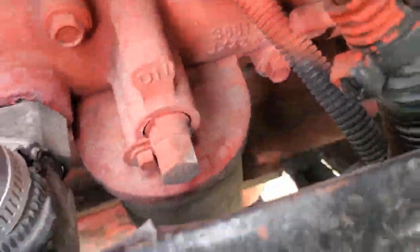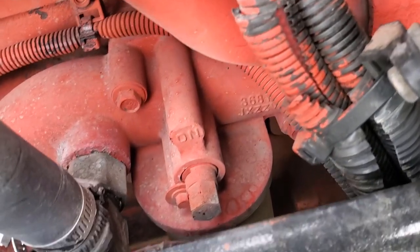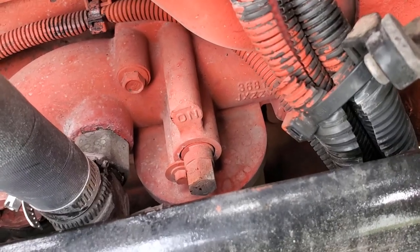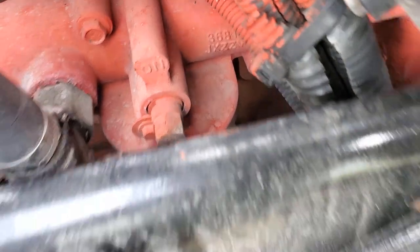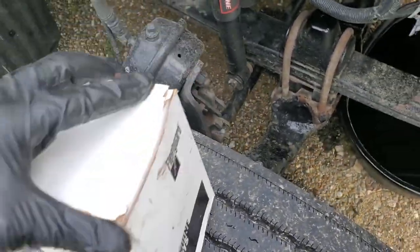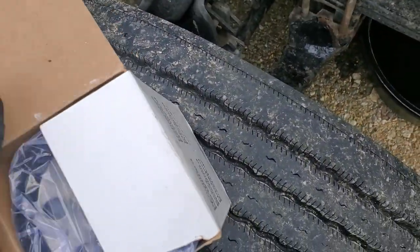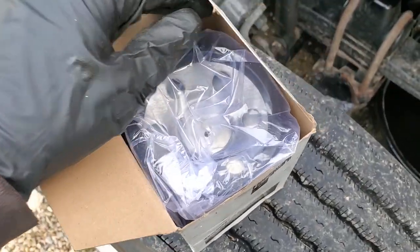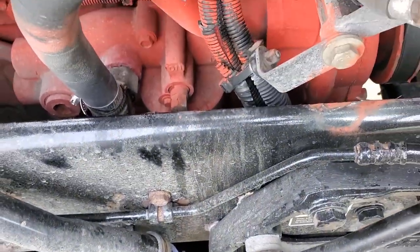The coolant filter is right here. There's a valve — you turn it counterclockwise and that'll shut it off so water isn't draining out. Then just spin the filter off with a filter wrench. The new one is a regular spin-on. Once you get the new one on and it's tight, turn the valve back on and you're done. Pretty simple.